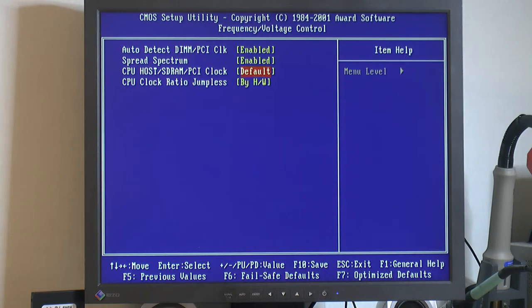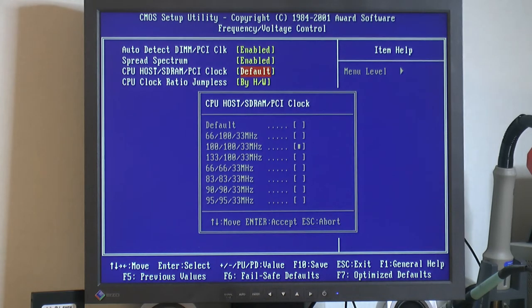I suspect the 630 is doing either the same thing, or this BIOS board doesn't allow 133 on the memory for whatever reason. And if it's the same as the SIS530, it kind of makes sense not to even have an option in the BIOS, because you have no upgrade path. You can't disable the IGP and replace it with a PCI card or something. Also on the 530, I know you need to disable it with the jumper. It needs to be physically disabled according to the PDF for that chipset, and my other board doesn't even have that, so I can't even run 133 MHz on that even with a separate card.